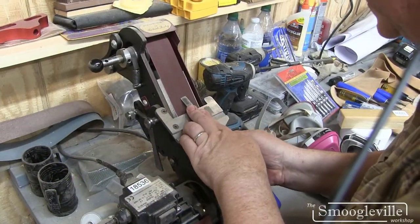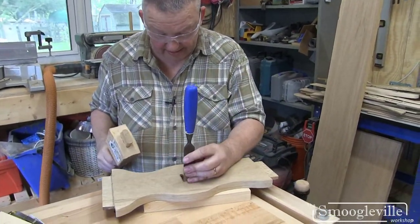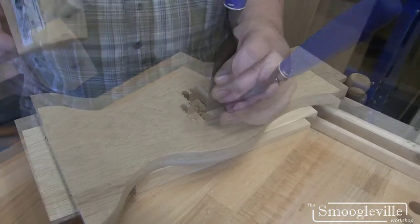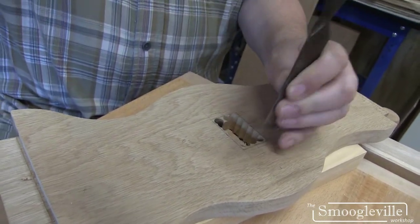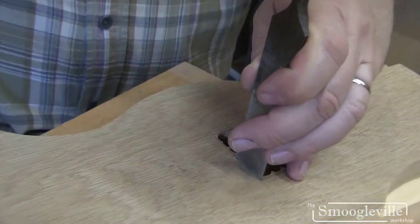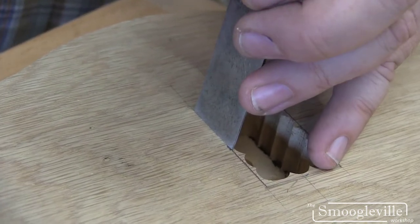I've sharpened this chisel and gone right down to stropping as well. So that should... Yeah, that is scary sharp right now. So we want a good sharp chisel, and we're going to go in here and start cleaning out these cuttings. So just go around the edge with a 1-inch chisel, drop it into the marking knife slot there, and